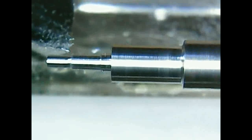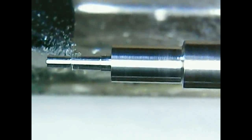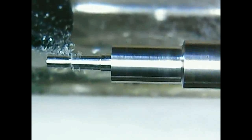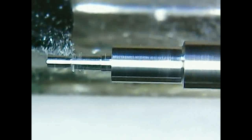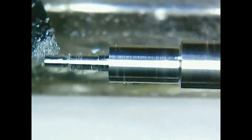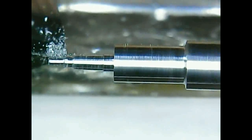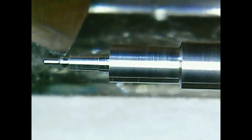Okay, the workpiece is hardened steel, hardened and then softened, tempered to blue. You may have heard of it as blue steel or pivot steel, but this is really hard. And this is why I recommend the tungsten gravers, because one makes it sharp only one time and doesn't need to care about resharpening throughout the process. With a steel graver, this is not that easy. One needs to sharpen it again and again. That's a big mess. So usually carbide gravers are not that expensive.